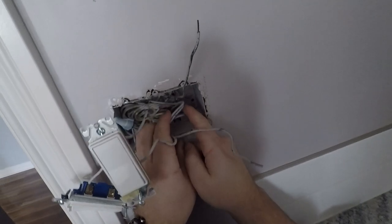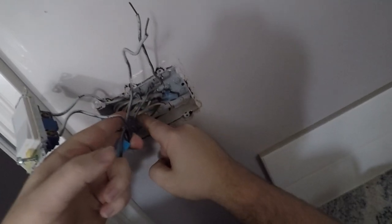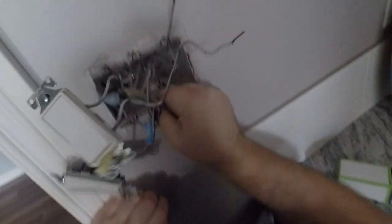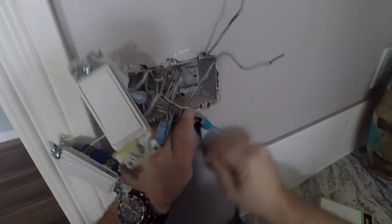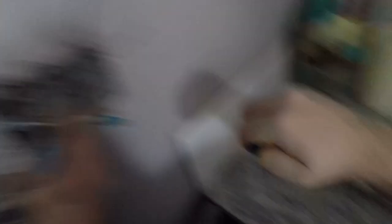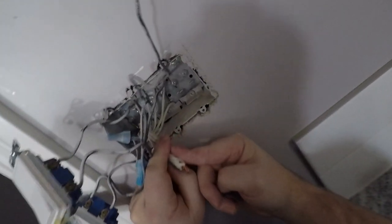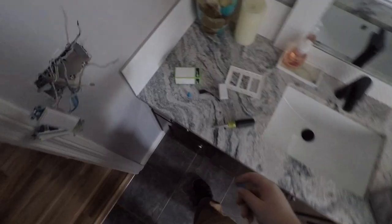However, these timers require a ground and a neutral, so now we need to pull out the neutral splice. I'm not sure why this is taped — oh, it's because they didn't splice it. We'll undo this. They've got a wire nut open on there, so we're going to put a bigger marrette on there anyway. I grabbed a bigger marrette as well as an extra one just in case we need it.